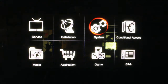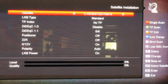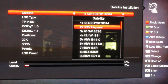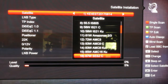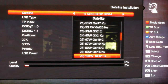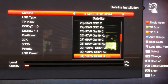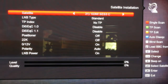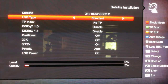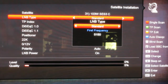If you go to menu and come over to installation, then satellite installation, you'll see all your stuff here. Say you want to set up — I'm going to go through setup one here, and right now I've got the dish. I'm not going to go through every little detail because a lot of it's just like any other FTA receiver. The dish is pointed right at 103. So you go in here and it should be set up properly. Unless you've got something else you're using for C-band, you need to set and change that.